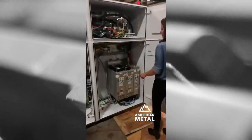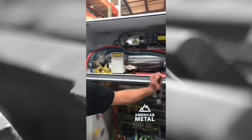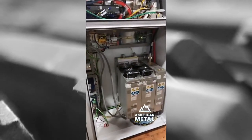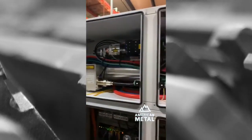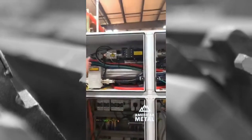This is the backside of the machine where some of the brains are. We have incoming power on this side of the machine. It comes into what we call a generator — the generator is where we can generate upwards of 2500 watts. That power then comes up into what we call the resonator. The resonator mixes gas and electricity together, excites them, and out comes the laser beam.